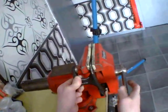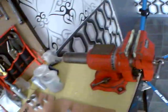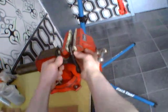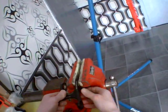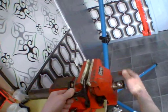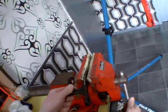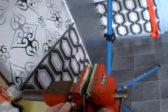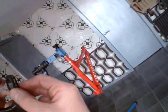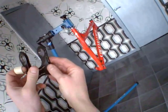Take your other jaw and close it towards the bearing. Once you have it at this point, take it back out and use the old bearing to seat it flush in the housing. Don't be worried about readjusting — just do whatever you need to. Nice and gently, then take it back off. Come to the back of it and visually check it.